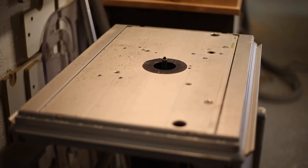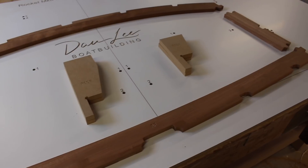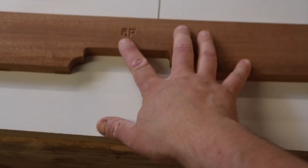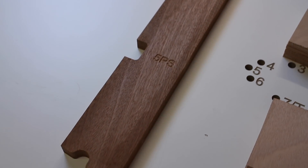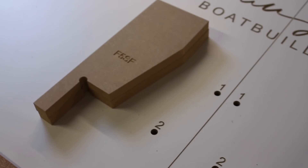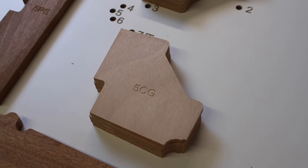The first thing I'm going to do is get all the parts cleaned up for one frame and get them on the board. This is the basic makeup of a pretty typical ring frame - a frame that goes completely around the deck with no openings. The numbering has most parts labeled with the frame number at the front and then a letter. So we've got five floor, five port side, five deck beam, and five starboard side. We've also got the constructional supports: frame five support forward and frame five support aft. Then we've got the gussets - five chine gussets and five shear gussets. That's pretty much it for frame five.